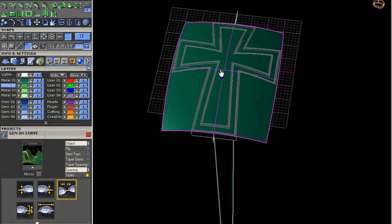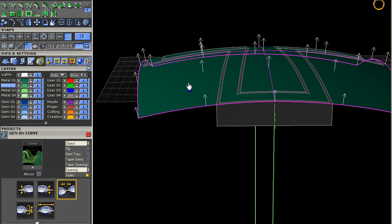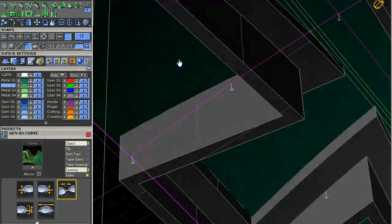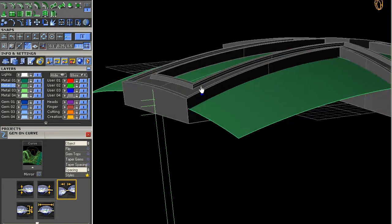Alright, so the gallery comes after 1 mm, so I'm gonna offset this 1 mm. You know exactly over here it's 1 mm, so I'll make it 1.05, so I don't get any error when I do the boolean difference. Sometimes when you have exactly matching surfaces, they don't cut each other. So for the safer side, I'm gonna offset 1.05 and press enter. Okay, I don't need this, so delete this one.